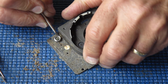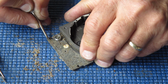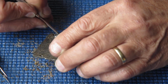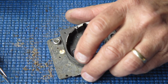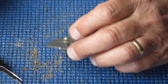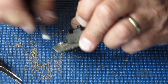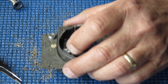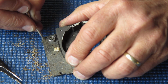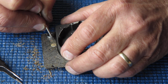It's difficult to get your leatherette fitted around this flash contact easily. The leatherettes, of course, have usually shrunken over time, so they're reluctant to fit over that boss anyway. 99 times out of 100 there'll be a break in the leatherette at this point, but of course it's invisible, so it won't cause you any bother. Because it's so hard to get the leatherette fitted back firmly at that point, it's not uncommon. Well, in this case there's a lot of adhesive heaped up there because the leatherette was never pushed back against the body.